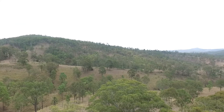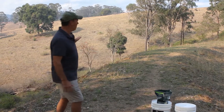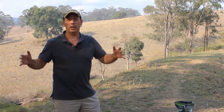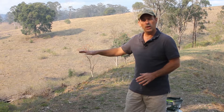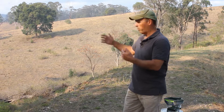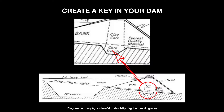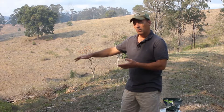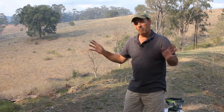What we feel has happened is that they haven't actually constructed a key. I'm standing on top of the dam wall and you can see it really drops away quite significantly. The dam is not that big, and the reason is there's a massive amount of soil that's been placed here to dam. If they'd travelled further down into that water course where the grade isn't so steep, they could have got a deeper dam and it would have been much easier to construct rather than pushing it hard up against the top of the hill. What happens in those situations is that water travels down along what was natural ground and underneath all the soil placed on top. Whether it's clay or good material or bad material, if you don't cut a key you really can't stop the water pushing underneath your dam wall. So we've got a massive slope working against us and a dam wall that's been constructed — this is just a problem waiting to happen.